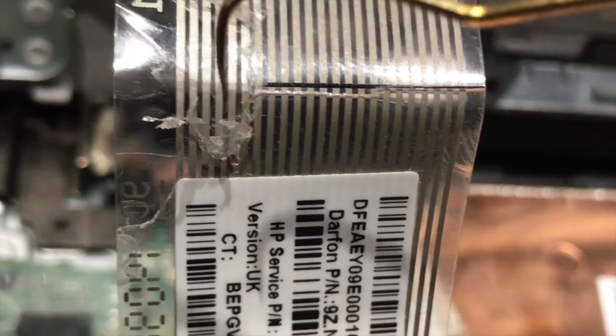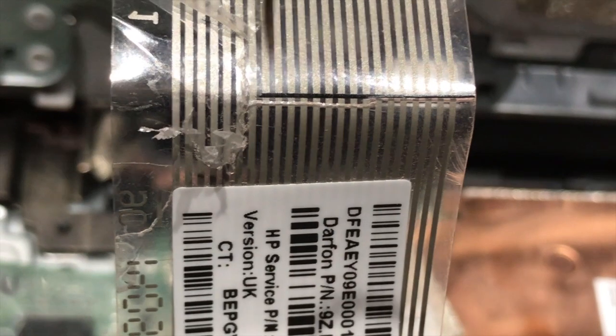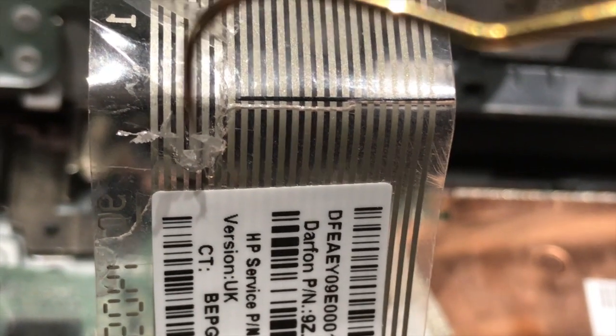However, I've come up with a simple solution. With a sharp hooked probe you can actually get between the individual tracks and tear off the supporting sellotape that's on top, without damaging the tracks underneath. Basically what's happened is — you can see there — there's a crease, and this crease has gone across and snapped some of the tracks.